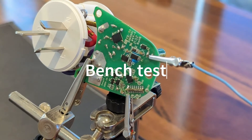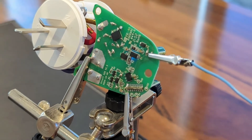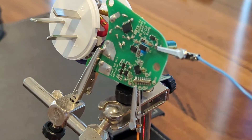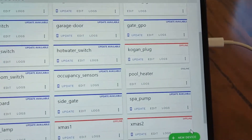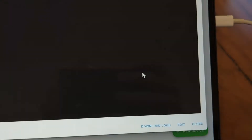My test bring-up is just to unclip those RX and TX wires and unplug the USB connector from the machine and plug it back in. That's enough to give 3.3 volts into the chip and it'll connect to Wi-Fi. And look at that — the pool heater thing is showing as available and online. Have a look at the logs. Done.